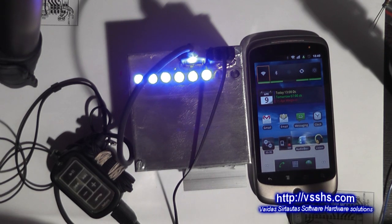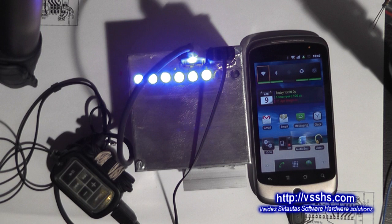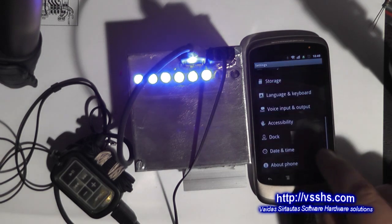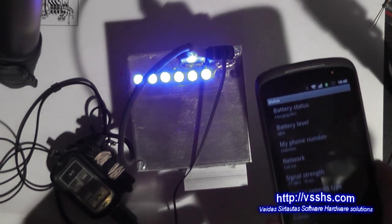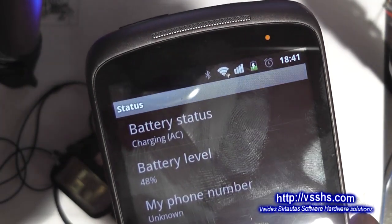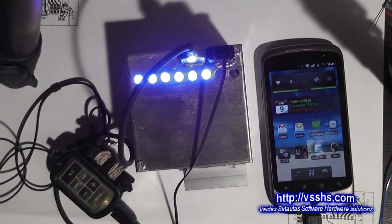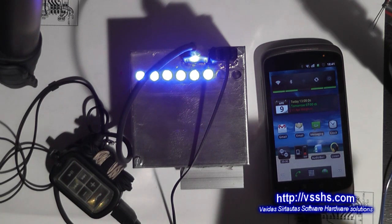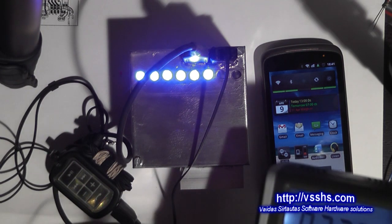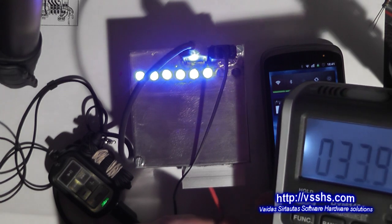Now a bit about the way the system was built. There is a LM338 adjustable voltage regulator rated at 5A that is providing regulated voltage from two parallel connected lithium ion battery blocks, each containing three cells connected in series. The output of the LM338 is controlled by an ATmega328 microcontroller, using implementation guidelines from the voltage regulator's datasheet. I was able to turn off the output of the voltage regulator using a simple TTL signal from the microcontroller.